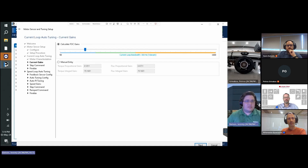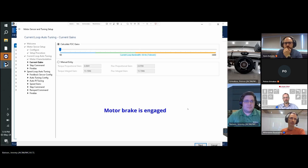Once complete, click Next. Here you will select an FOC bandwidth, which determines the responsiveness of the current loop. We will start by selecting the slowest bandwidth of 50 Hz — this will not be the final setting, but we'll use it to explore the impact of different bandwidth settings on the current response. We are locking our rotor using the motor's built-in electromechanical brakes to allow easier application of motor current, though this is not required for optimal results.